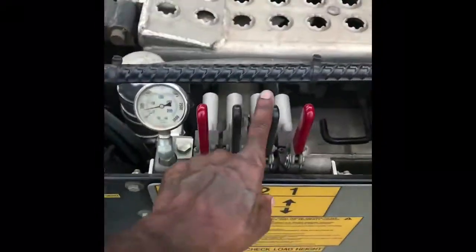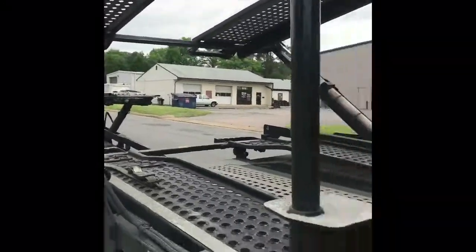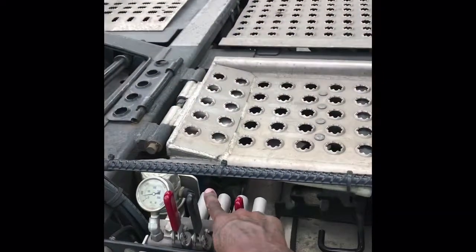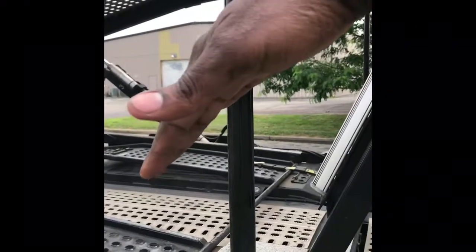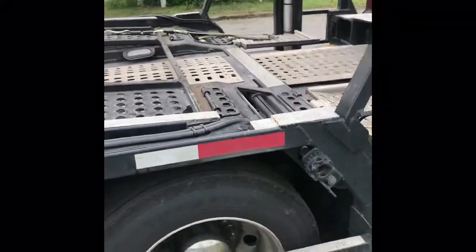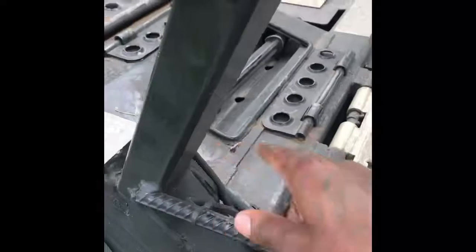It pans up there so you can adjust how low you want to drop it. The second position — this knob basically lowers this deck. The first one lowers the back end, and this one right here lowers the front end. So basically you can have it tilted like that. You always want to have the high points of the vehicle facing down so you can have your lower height clearance.